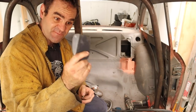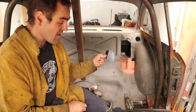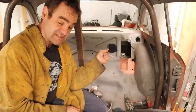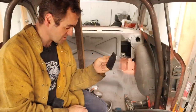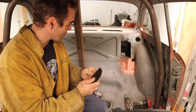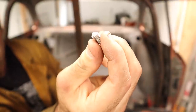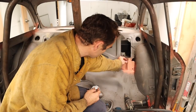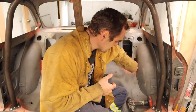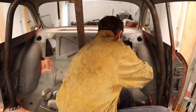I folded up my base plates for the feet of the cage. The main part of the foot is going to sit here, bolting on this corner and this corner. The issue is I need to line up the holes with the plates I already welded in the car. I should have done these off the car first, but I'm not that smart. So now I've got to do it on the panel using these little transfer punches — I took a bolt on a grinder and turned it down into a transfer punch, then screwed it into my captive nuts, held my plate exactly where I want it, gave it a tap, and now I have marks where I want to drill my holes.